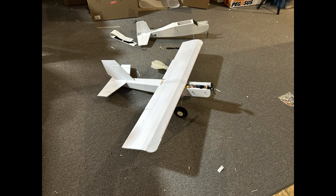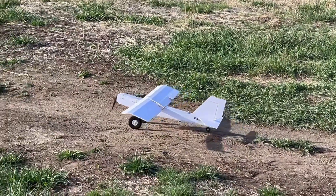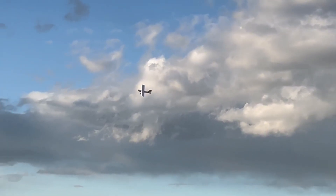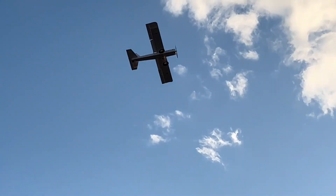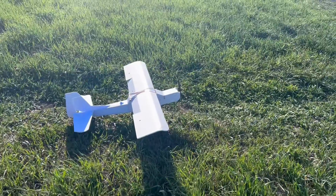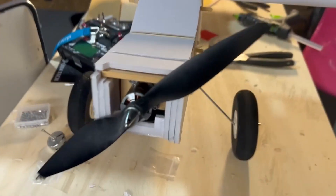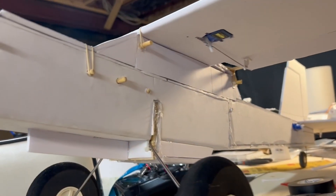After that, I made a new airframe with a super thick fuselage to make it more durable, and a much larger horizontal stabilizer. Compared to before, it was flying a lot better and more gracefully, but there was still the issue of the tail dropping and difficulty in turns. I was also disappointed in how much a tiny breeze would affect it — with the size and weight of this plane, I felt like it should have been more immune to wind. To fix the tail dropping issue, I made an even longer and bigger horizontal stabilizer, and for whatever reason also added a cabin thing that made it look like an RC Timber — not for any practical reason, just because I thought it looked cool.